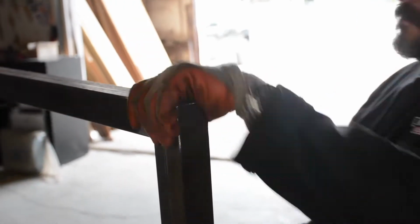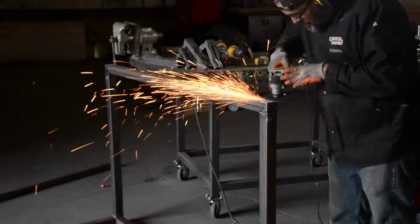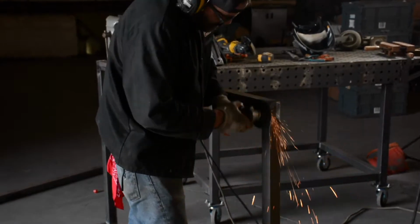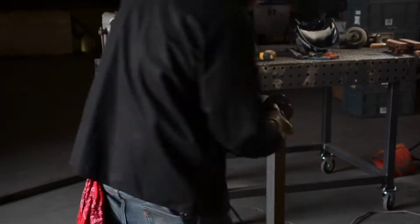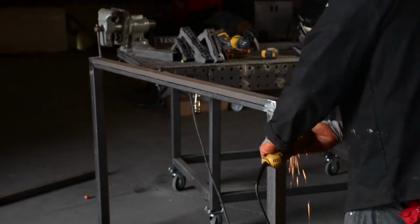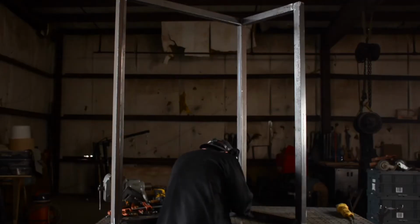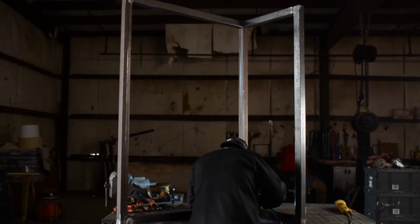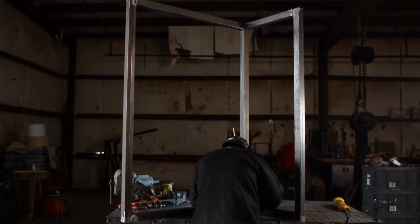And there's the electric grinder with that 36 grit disc on it. And once I grind all these welds in, I have a nice clean capped corner. Now you might say, why don't I just do a 45 degree intersecting a 45 degree? That's because the two sharp points that make up the outermost corner are too fragile. When you weld them, they just immediately melt backwards.